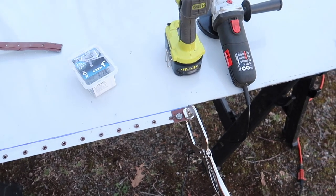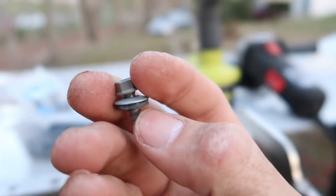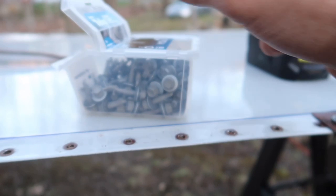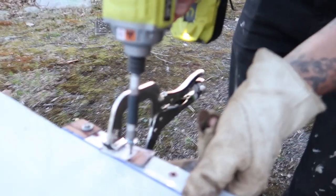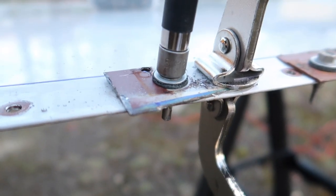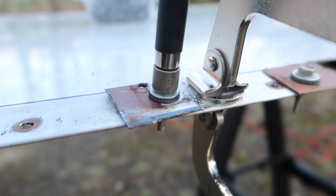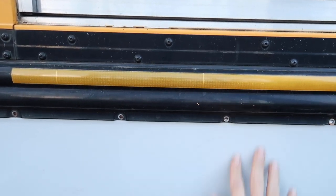Here is our solution for fastening the new sheet metal onto the side. Instead of rivets, we're going for these self-drilling roofing screws — one inch with the little washer underneath. When you drill through the sheet metal, the washer kind of squishes down and gives you a watertight seal. Just get the screw and it just drills itself — as easy as that, done. The tighter you go, the squishier the washer gets. You want to just back it off until you've got the desired amount of squishing. Then the sheet metal just slides straight on under there and the water will run down and straight off.